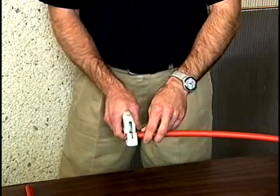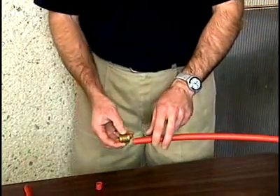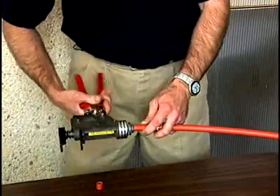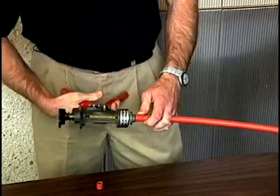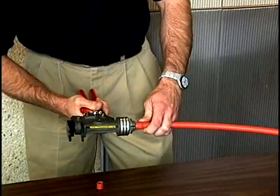The first step will be a clean square cut. Then we take the compression sleeve, slide it over the end of the pipe with the beveled or tapered end towards the end of the pipe. Put the tool inside and a few pumps to expand the pipe. Release the tool, rotate it just a few degrees, then a second expansion to make it round inside.